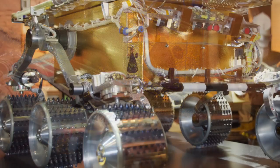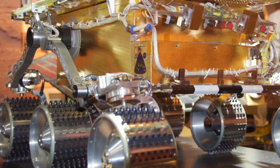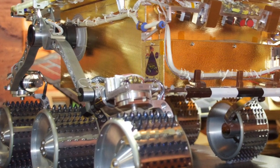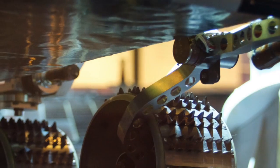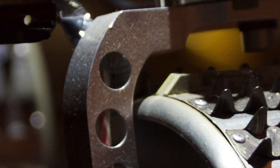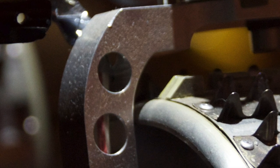Or, more curiously, the incredibly difficult-to-machine wheel support arms. At first, I thought these might have been additively manufactured on a laser sintering machine, but after finding no reference for use of the technology by NASA in the early 90s, I started to look closer. The surface finish on the arms and the geometry of the mounting interface suggest that it was conventionally machined, and if you look closely at the inside profile of some of these arms, it does seem possible that they were hollowed out with an undercut tool.